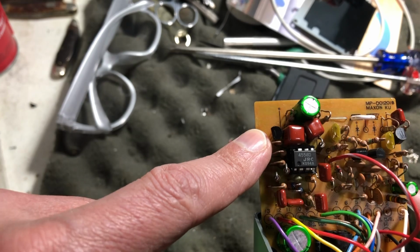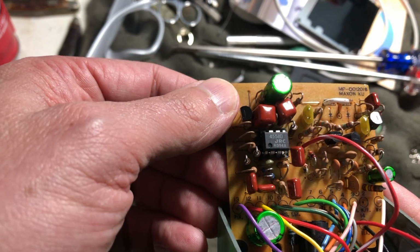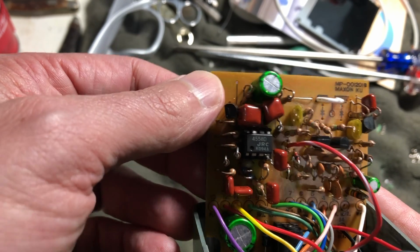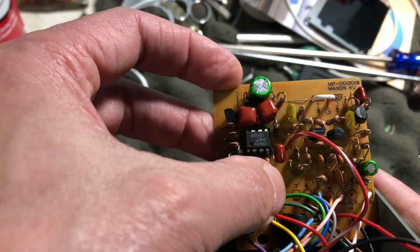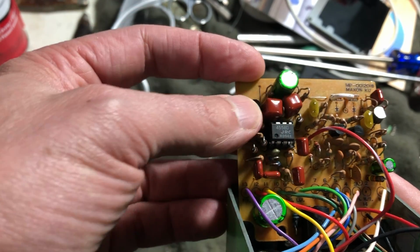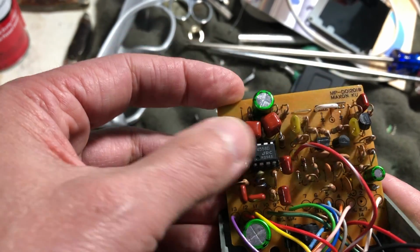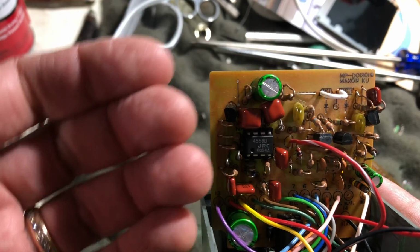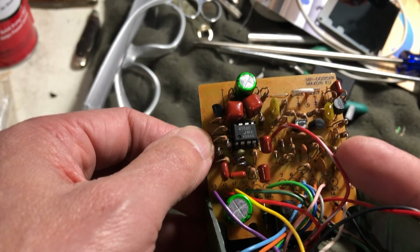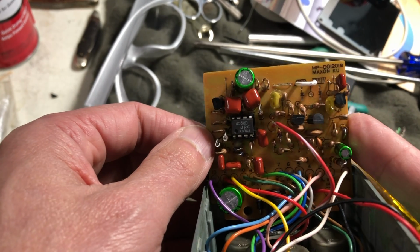Now, this is a replica of the Analog Man Silver Mod. This is not an Analog Man pedal, but I have studied these thoroughly and have done literally 50 or 60 of these mods. And I've come down to all the high quality parts that I order, all these fine metal film caps, these guys here, all Panasonic: closer tolerance, quieter, better bass response. That's what it all comes down to. Now, your Tube Screamer is your Tube Screamer. This thing sings, it sustains, it's very tight and punchy, and it's clear. The mid-range has been cleared up a bit. It's articulate, but any of these mods does not make it sound like another kind of pedal. It's still a Tube Screamer type pedal, which is the beauty of it.